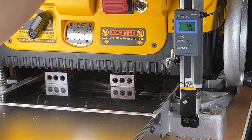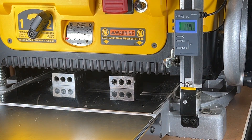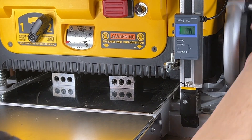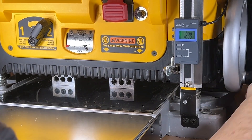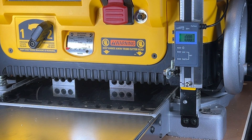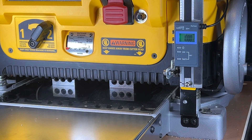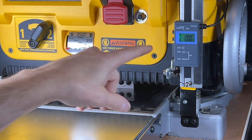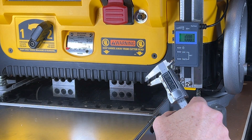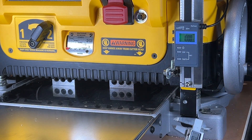I've got the battery installed and I'm not using USB at the moment. I've put a couple of 1-2-3 blocks in here with the one inch side facing. I've got this thing pretty close to calibrated with the one inch blocks. What I really need to do now is plane some wood and then check it against my dial calipers. As you can see, with the surface down on the 1-2-3 blocks, the one inch side — I'm at one inch on the readout. Theoretically, when I take this back out to the shop, I should be able to plane a piece of wood and the actual thickness should show up here, and I'll verify that with dial calipers to confirm the readout matches the actual thickness.